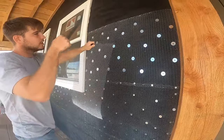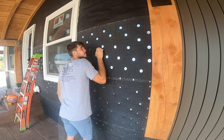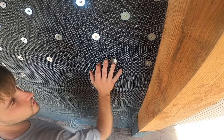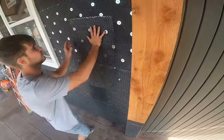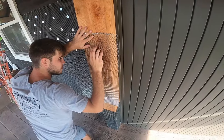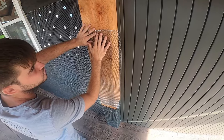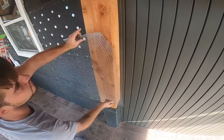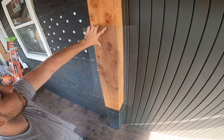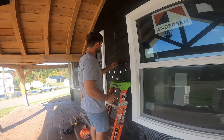There are two sides to this wire. The way I look at it is like this: you want to be able to climb this stuff with your fingertips. You can literally hang on this with your fingers - you can see it's angled down so when you put the mud in there it'll hold it. If you do it the other way, you would slip right out because there's nothing holding you. You put the mud in there and it'll just droop out - it won't hold. So it's got to be flipped around the right way so the mud doesn't fall out of your wall.